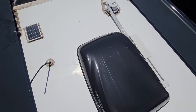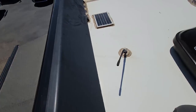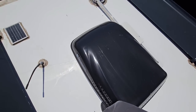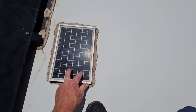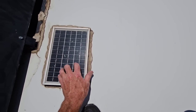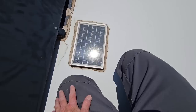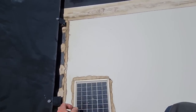The third AC is up here. I had the ACs running, and you can see that condensate just comes off and goes into the gutter, then down the sidewall — so you don't need crazy plumbing underneath the ACs. We made sure it's not loose. There's a CB antenna right there. There's also what I'd call the manufacturer's solar panel gimmick — this is just an 8-watt battery maintainer for the chassis battery. It'll maintain a fully charged battery, not charge a dead battery, and you're definitely not going off-grid with this panel.